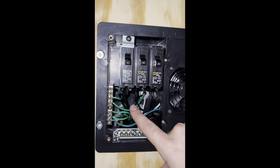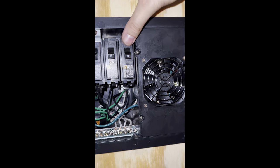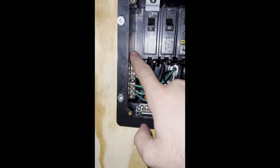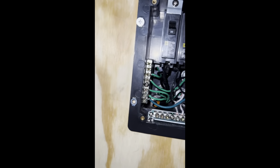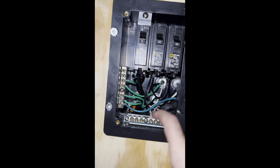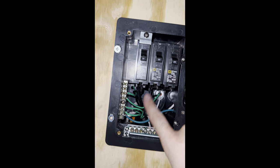I've got my 30 amp main breaker coming in for shore power and two branch circuits coming off it — 20 amps and 20 amps — because I'm not sure exactly what I'll be running. We may be doing espresso, so we've got to run an espresso machine and blender. This wire was already attached up here; I just moved it down to clean it up. I took the black wire from the converter up into there, locked it in, and then ran in shore power neutral, and the two branch circuits — hot going in, ground going over here.